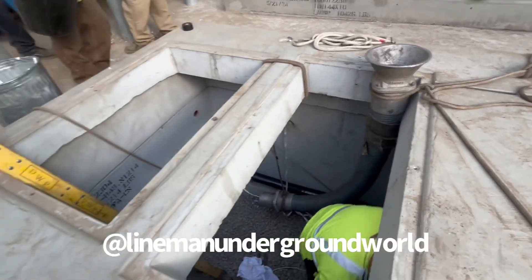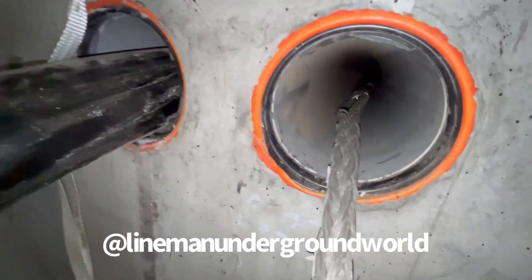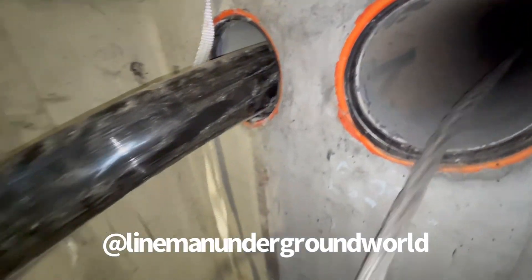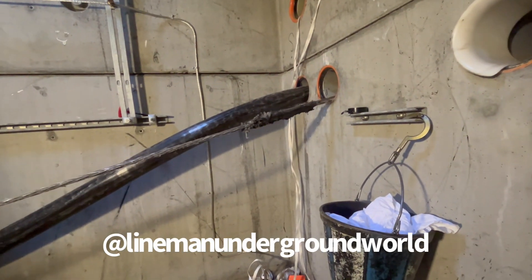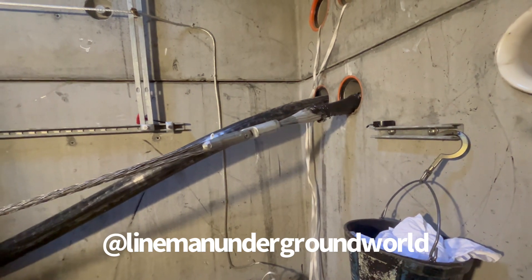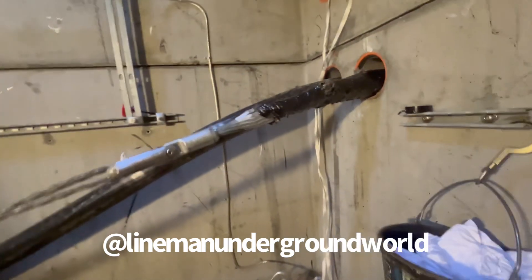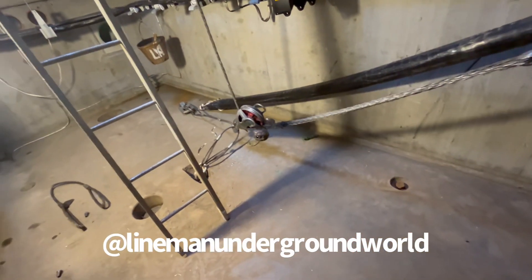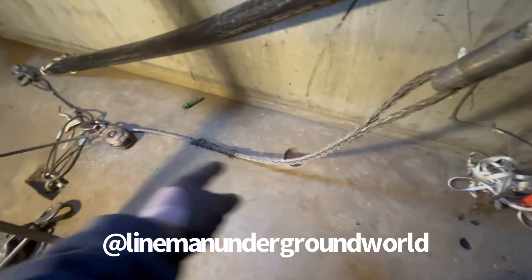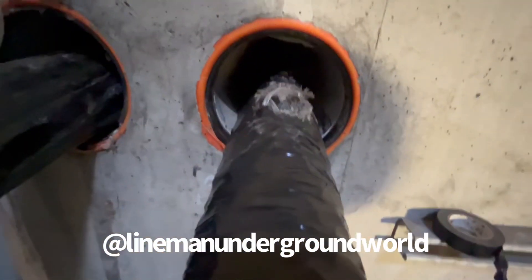Free tubes — I'm taking it. Pull number two. Here comes our cable, and this time we're using the pulling sock. We got a little bit of extra cable so I changed out the block so it'll go through the thicker part and try to get the most out of it. Whenever you're ready, Mark — pull number two.